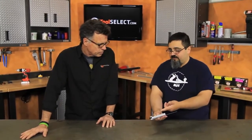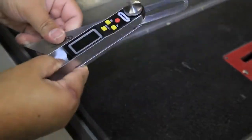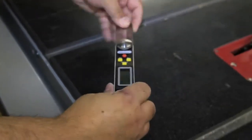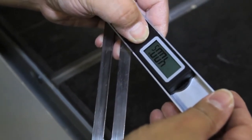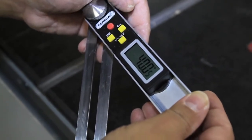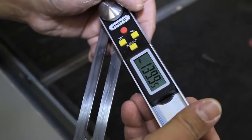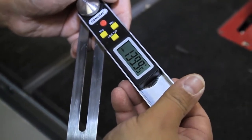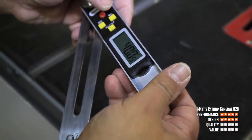Even if I know it's 50 degrees and I walk over to put that on my saw, I can knock it out of position and it still keeps the reading on there, so I can reference it on my other saw instead of having to write something down. Another neat feature is the flip button — hold it down and it flips the readout for whatever direction you're looking. And there's a reverse button, so if that's 43 degrees, it will tell you what the opposite of that is.